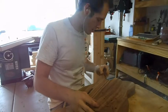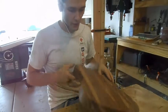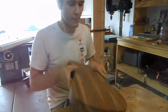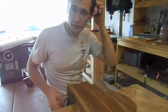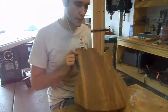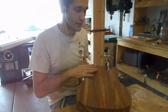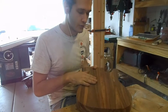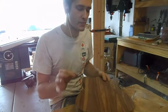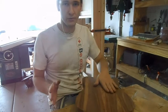I've just roughed it out and I'll go over it with progressive sandpaper. I'll sand it with a palm sander when it comes time. What I'm going to do now is thickness sand it on a spindle sander. I don't have a planer, so I'm going to set up a guard with the spindle sander and run it through pass by pass, taking small very thin amounts off each time.